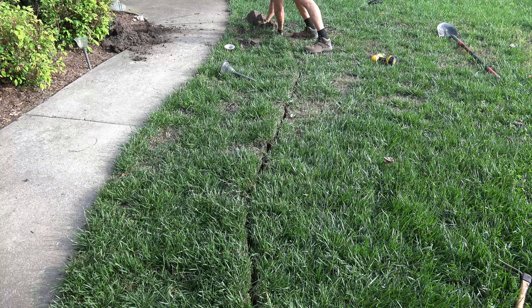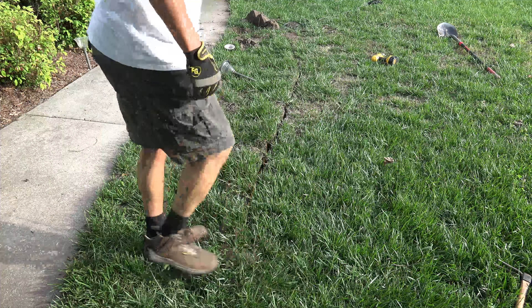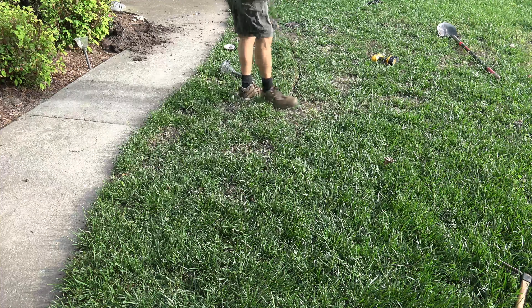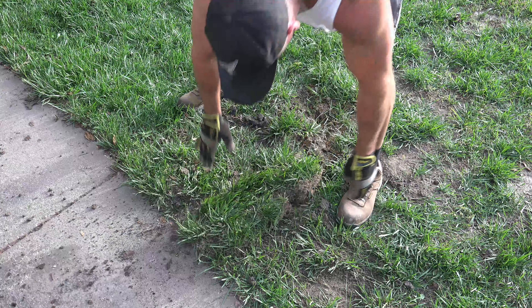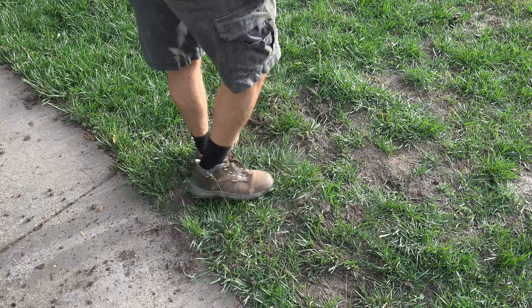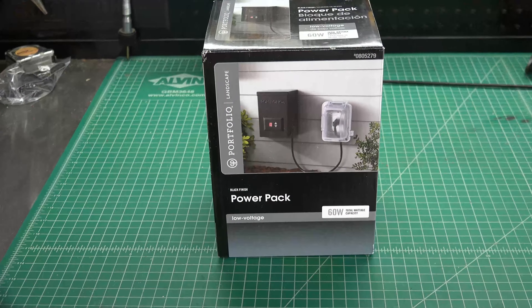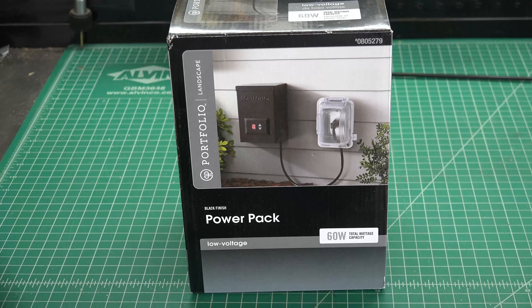This process is really kind of simple. First, make sure your drill bit extends the distance of the sidewalk. Now you need to cut a plug with the shovel that will allow the entire drill to fit in it. We do not want to destroy any grass, so cut your plugs in straight lines to ensure they don't fall apart. Once you have a good solid sod plug out, you can do normal digging to ensure you are below the concrete of the sidewalk.